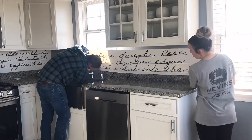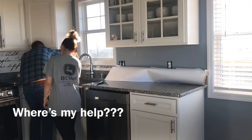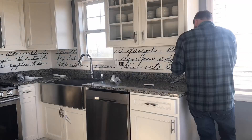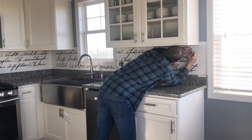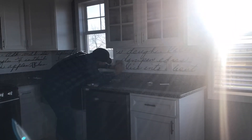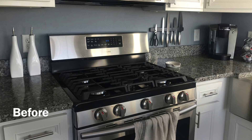We had ours printed oversized — a little taller and wider than needed — so when you get to the underside of the cabinets you simply cut where the wall and cabinet meet and cut off the excess canvas. Same thing at window trim: go all the way up the side of the trim, then cut down where the trim and wall intersect — that's how you end up with a perfect match without any open gaps. Once finished, go back over the receptacle and light switch boxes, squeegee down to those boxes to eliminate any wrinkles, then put your covers and switches back on and all your decorations. That's all there was to it. Here are some before and after pictures.